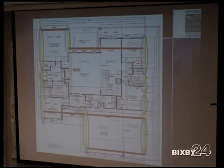So that's the three rules, the three things that you have to check. Do I have enough bracing? Am I 12.5 feet from each end? And are they 25 feet on center?